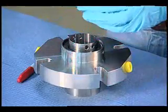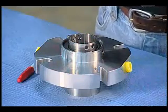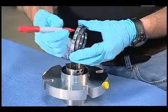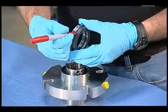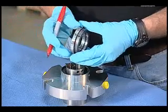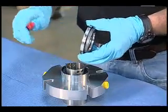Take your time. If I need to, I can put this assembly back on exactly like it was. Just like I put this mark on the driver, before I take the seal ring off I'm going to mark it as well — that way I can line everything back up exactly the way it was when I received the seal. Not always important, but someday this is going to save you.